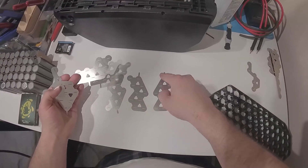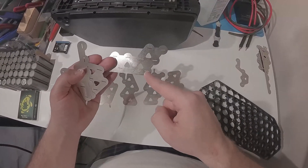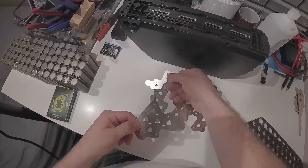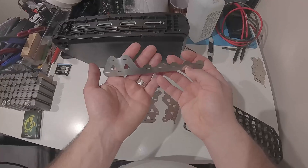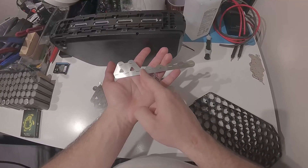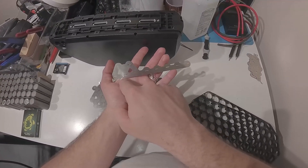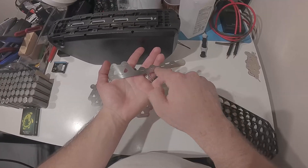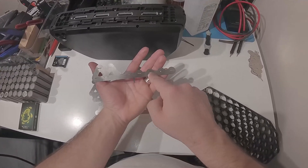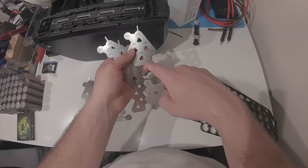In some connectors you have them evenly split so the cross section between the negatives and positives is long. But where you have a hot spot, you need to add extra nickel. The terminal connections are fine. The problematic one has all negatives on one side and positives on the other with a very small cross section. If you're going to use this, definitely add a layer of nickel at those points — one nickel strip there, one there, one there. The rest are fine, though one might benefit from an extra strip too.